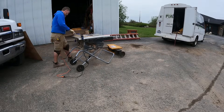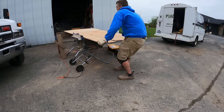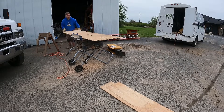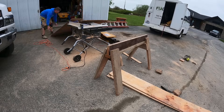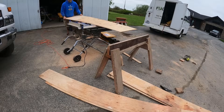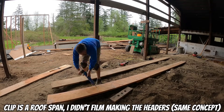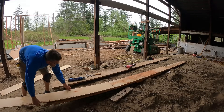I'm going to use my portable table saw, which is way too small, but my shop is an absolute disaster right now so I just grabbed this out of the truck. These are the strips I'm going to cut. A 2x12 is actually 11.5 inches, so I'm cutting these to be perfectly level. This is what I'm going to sandwich between those 2x12s and 4x12s to make our support headers. I'm going to glue them together, use a couple shanks of nails, and make them extra strong.